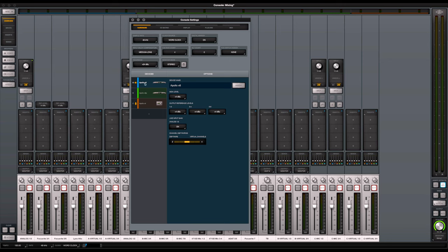Back in the settings: the X8P has a digital input/output option labeled SPDIF and ADAT. It says SPDIF but it doesn't actually have SPDIF — it uses the ADAT channel as SPDIF. The difference is SPDIF is stereo while ADAT gives you up to eight channels. So I use ADAT for input and output instead of SPDIF to get the full eight channels. The X6 has both actual SPDIF and ADAT on the back simultaneously, so I get eight channels plus a SPDIF channel.